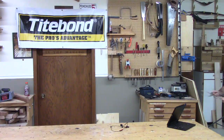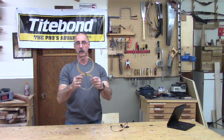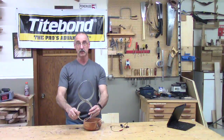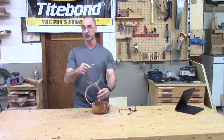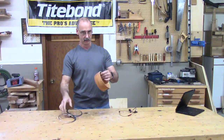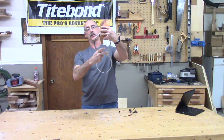That thing right there. With this, it's a great benefit, because if you want to see what your body fat content is, you could. But what these are really for is bowl calipers. Whatever I read on this end, when I squeeze it, it's showing me on the opposite end what that wall thickness is. That's great on the wall, and I get that you're concerned about going through the bottom down here. So you can use these and also come around this way to some extent.